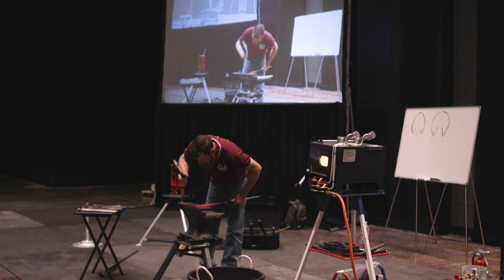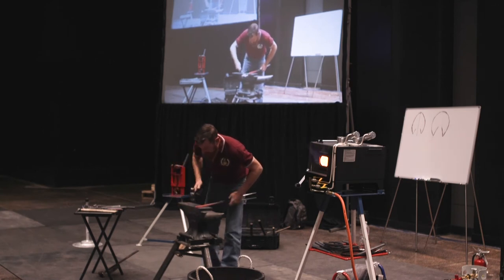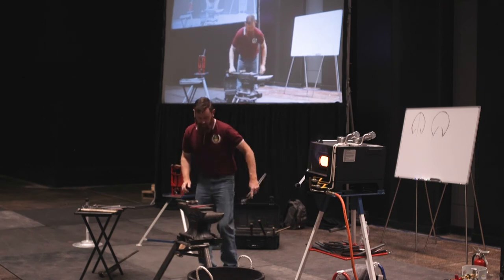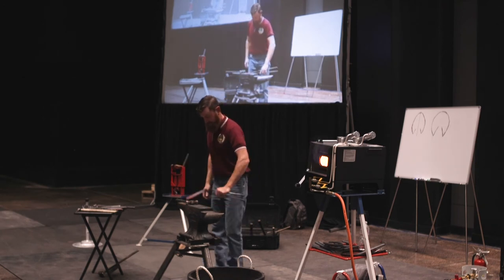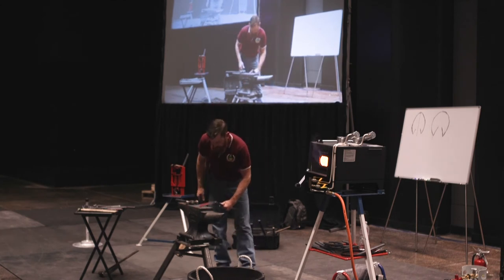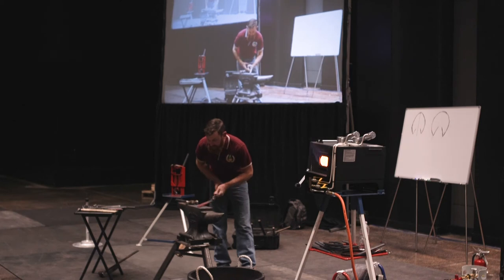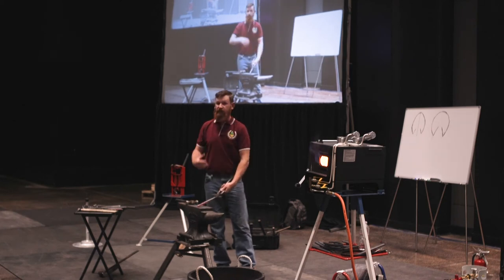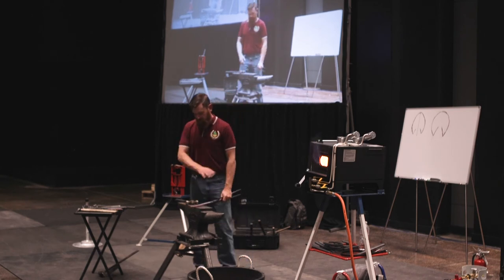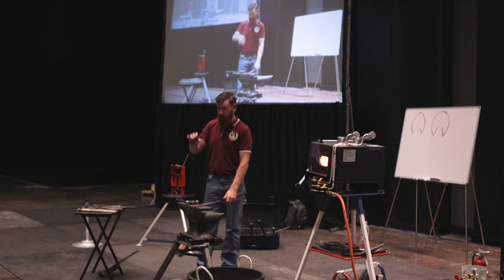I'm sure we can all agree that concave is one of the most unforgiving sections that we deal with in building shoes. So, in making that heel, I need to make sure that when I'm hitting it, I know exactly how I'm doing it so I can replicate it, and prevent big mistakes from happening that I can't take out. The hardest thing to do is get concave flat again once it's puckered down.